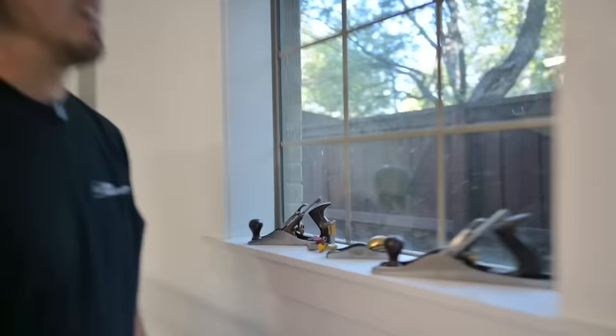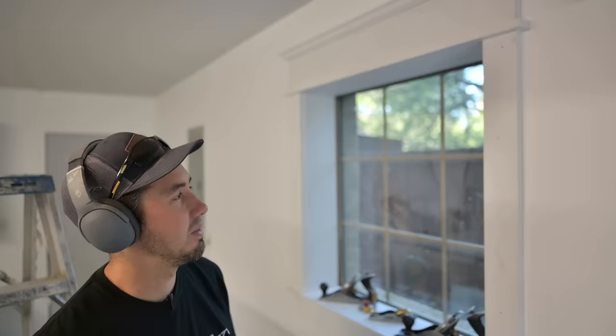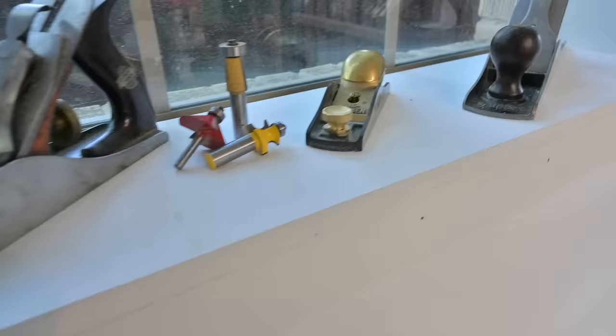All right, so there you have it. There's a super simple window trim install as one unit. Those are always fun to do when you can pop them in as one. Just kind of a satisfying feeling when it all works out. But yeah, this thing is simple. It's basically a bunch of rips where you need to rip. This is all pocket screwed together, nominal lumber sizes, and even the pocket screwing is kind of overkill. You don't even really need to do that. We finish nail these together sometimes, but when you got a castle machine, everything looks like a pocket, like I was saying.